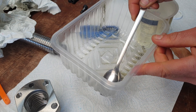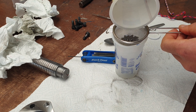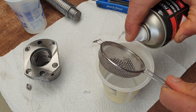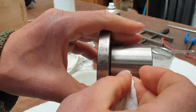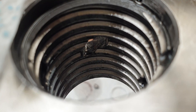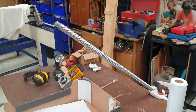After a bath in WD-40 these bearings are going in ethanol. One's gone on the floor and I get a final shower of brake cleaner. The diverters go in those little holes you see me cleaning up there and they're not terribly tight-fitting. In fact, a lot of the noise from the ball screw probably comes from that.